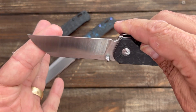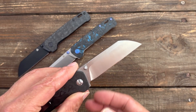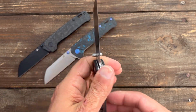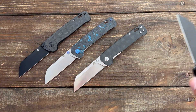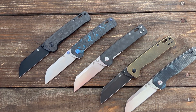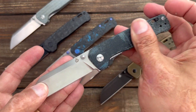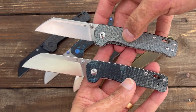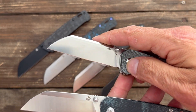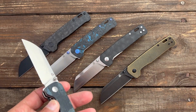I've sharpened mine up a few times. They're not the thinnest behind the edge — it's more of a work knife, around 23 to 24 thousandths behind the edge — but they still slice excellent as long as you keep a sharp edge on them. They're easy to strop, they hold a respectable edge. I think it's an excellent addition to the Penguin family. This was my original Penguin — I did a little mod work on it, practicing my swedges and then I crowned that front spot. Stuff you can have fun with too.